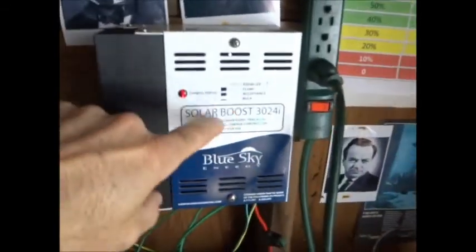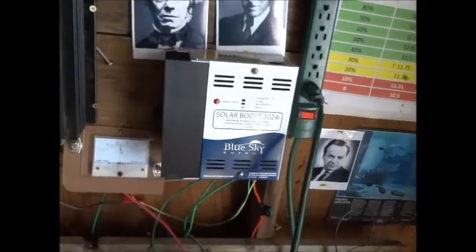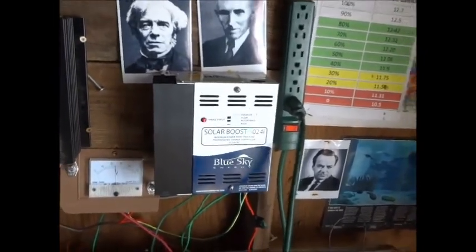If you're going to start out and you have some money, then use the higher voltage panels and get an MPPT controller. And what I'm trying to do is do it better. So what you could do is have maybe one big battery and have it on a day-night switch. What I'm trying to do there is have it on a photocell switch.